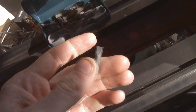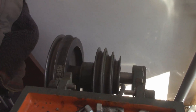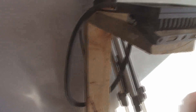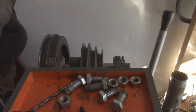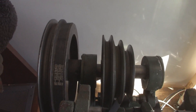It's incredibly difficult to do one-handed. I'm gonna try this one and see if I can get that thing apart. One of you suggested in my last video to get one of those segmented V-belts, so I'm looking at those now — I'll probably pick one up very shortly. It would make changing belts infinitely easier; you just slack it off, twist the belt sideways, pop it out, and you're done.